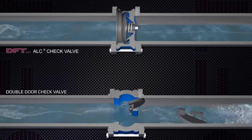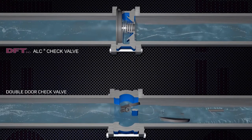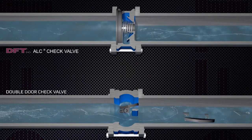The motion and slamming of the double-door can cause fatigue and wear on the valve stem and spring, which can lead to a mechanical failure and the disc being swept downstream. When the valve fails, you no longer have pump protection.